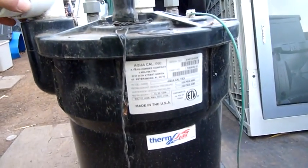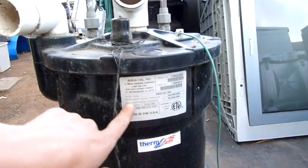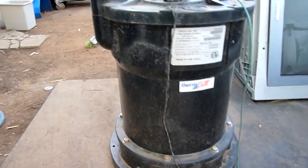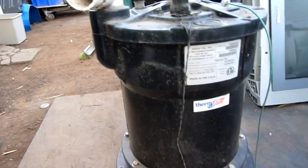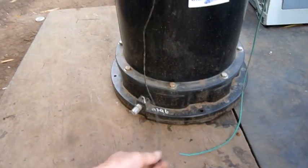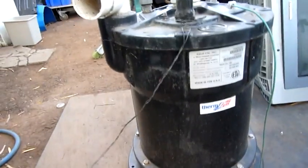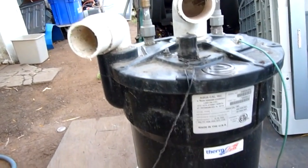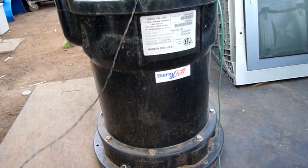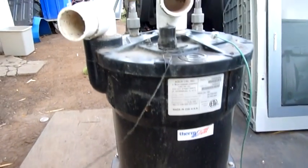We don't run very high pressure in these — it's basically just a swimming pool pump pumping in the water. But the design pressure for this is 150 psi, so this thing can take a lot more pressure than what we're putting through it, and it's still failed. It's always had water flow; it does have a water flow switch which should have been working fine. If it wasn't working, it wouldn't have been the only thing throwing up an alarm — there are several switches on the process line which would have denied start-up should there be no water flow, so it's kind of odd that this failed like this.